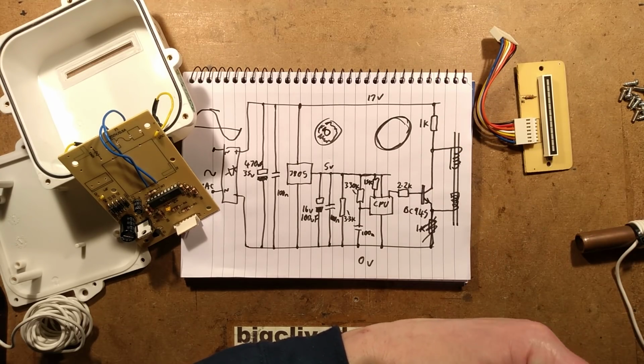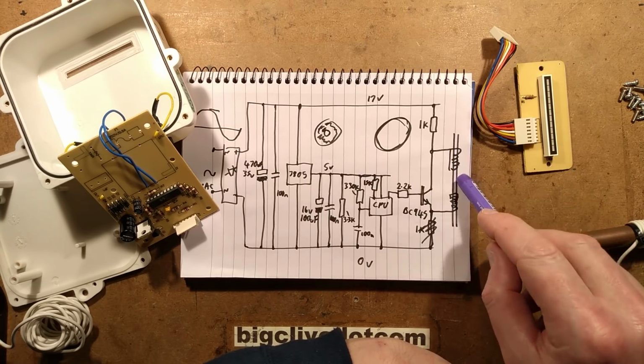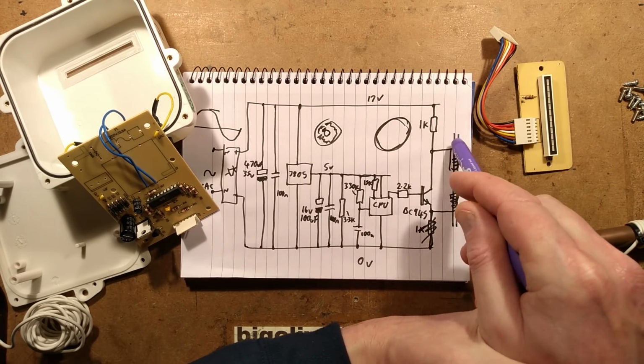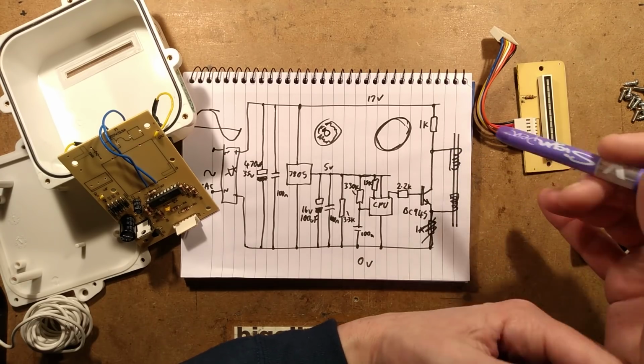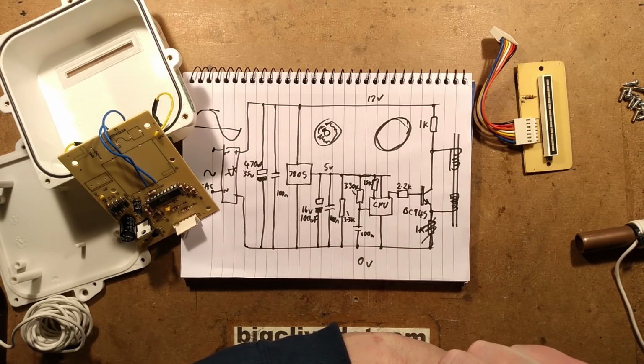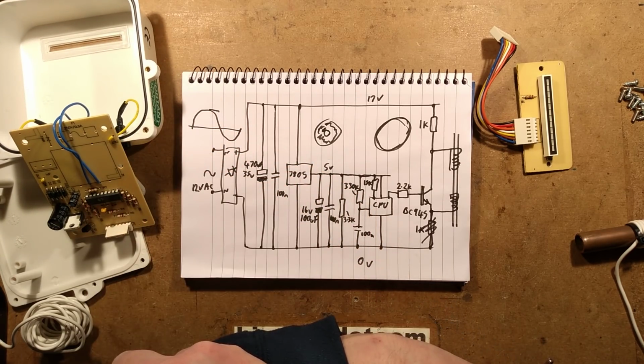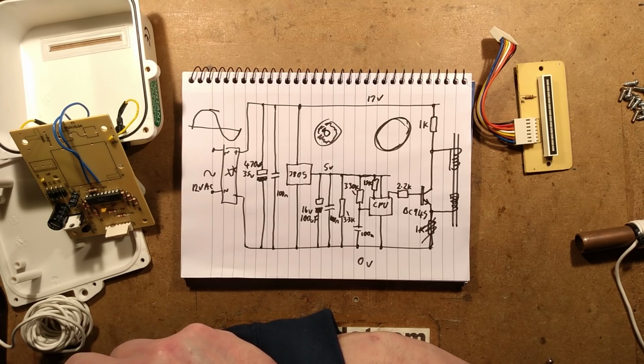I'll let you decide if these coils could capacitively couple. I mean, technically speaking, yes, it can induce current into the copper pipe, or if it was plastic pipe, it could induce current into the water, but not much current. But then, who knows, maybe it doesn't take much current to change the state of the water. This is what they rely on. So I can't specifically say, no, it doesn't work. But I can say that the output circuitry was less than I was expecting.